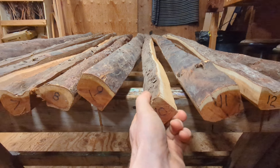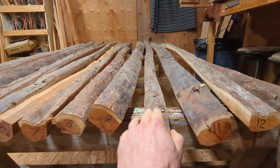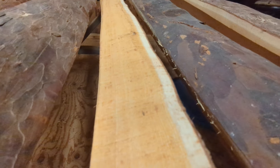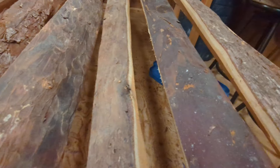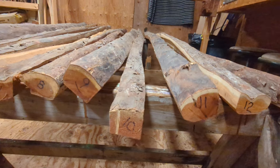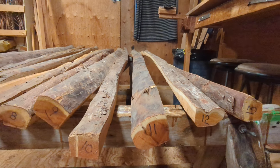Stave number ten, 82 inch — again a gentle S through it. From here alignment looks pretty decent but possibly a little heat bend for alignment. Front to back, a little reflex down on one end. Look at the colors and density, nice flat crown, pretty clean piece of wood, nothing major. A little knot there that'll disappear pretty quick. Real lovely piece, possibly a little heat bending. So that's number ten, 82 inch, and that's $150.